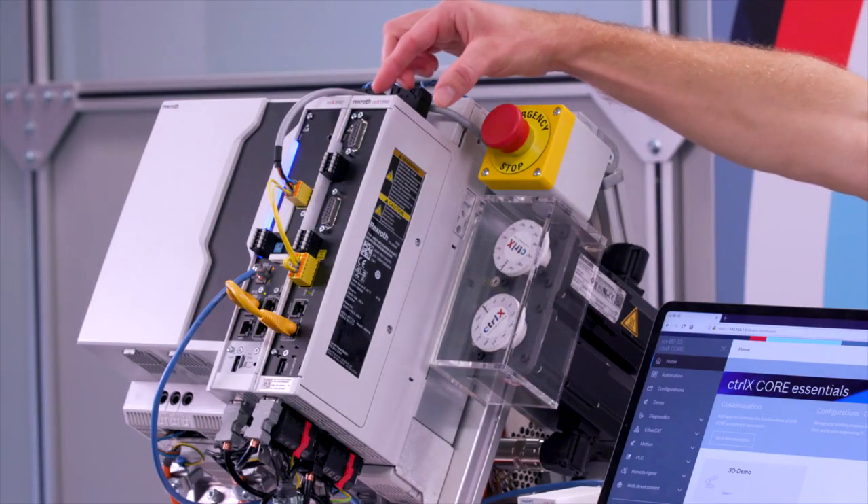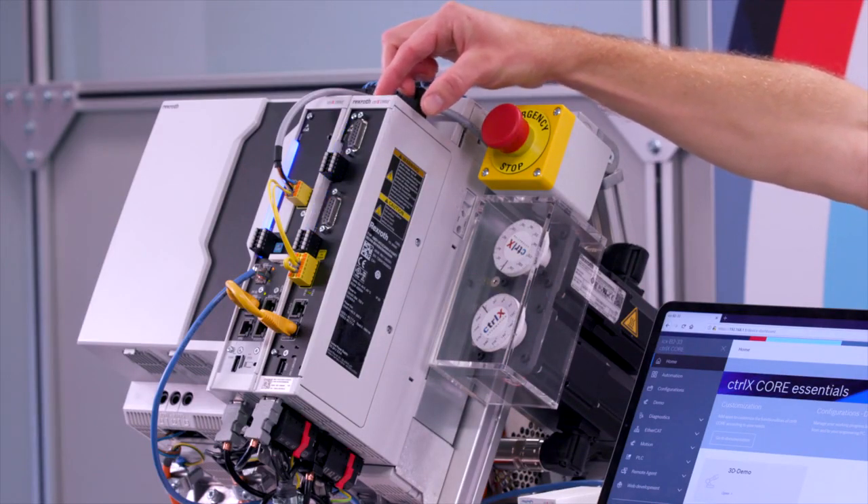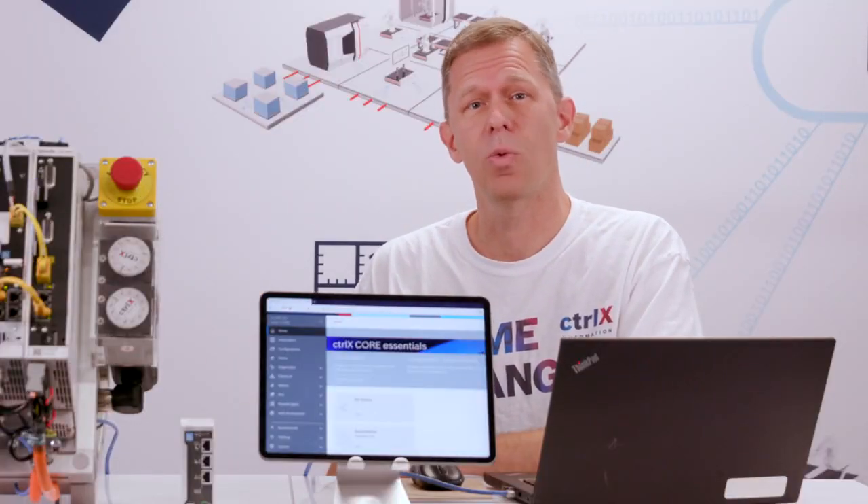This dual-axis drive is only 2 inches wide, so for example you could have 30 axes of drives taking up only 30 inches of panel space width-wise. The ControlX drive family can handle a wide range of applications with drives ranging from half a kilowatt to 110 kW continuous power and up to 210 kW of peak power.